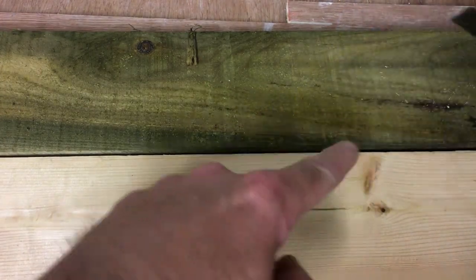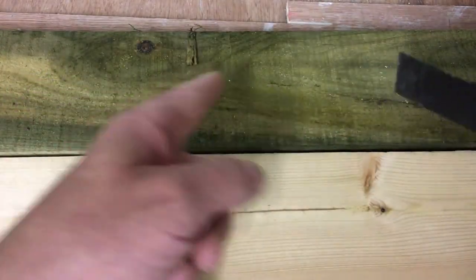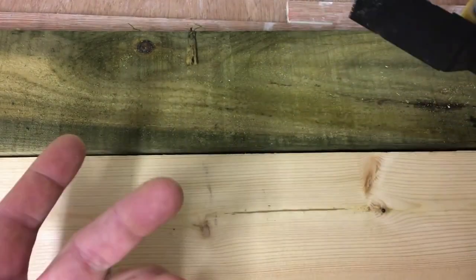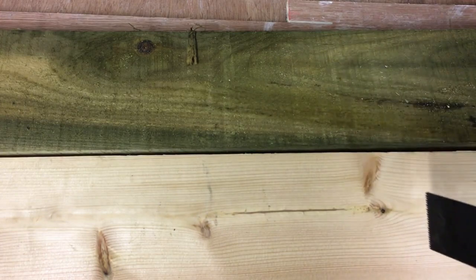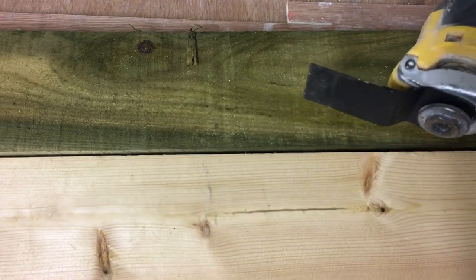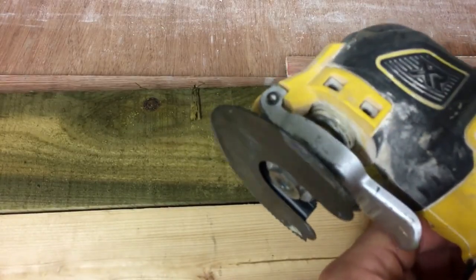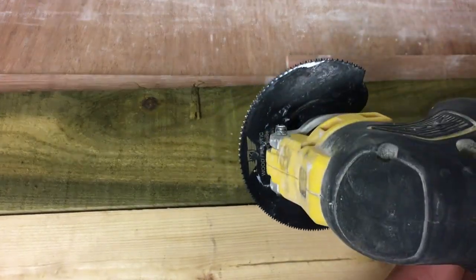Another common use in the same theme, whether it's floorboards or chipboard flooring, is to cut out hatches, you know, if you need to get under the floor, especially electricians or plumbers. The multi tool's excellent for that, you know, just plunge cut again, and you can cut the area out quite easily.